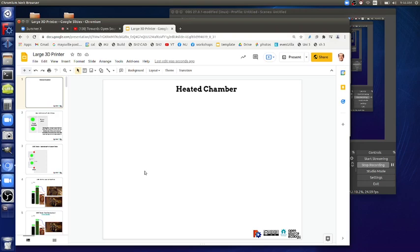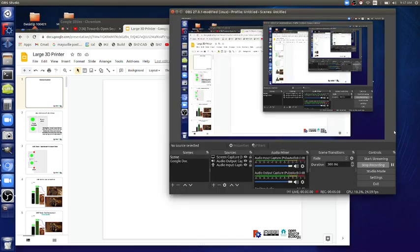Well, you wouldn't weld with the plastic in place. Yeah, we did that partially, but it's also just nice to have the piece in its final position, put the angle on top, and at least tag it. When they weld both tabs, it's bigger, so it's kind of wobbling around. So yeah, sure, but then you shim it. You've got to shim it at the end, no matter what. You can't weld it in place, you'd have to take it off. The angle isn't perfect, it has basically a camber, let's say.